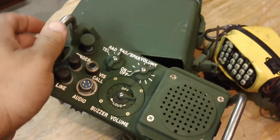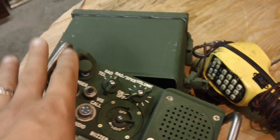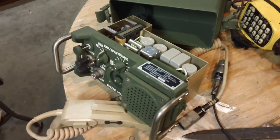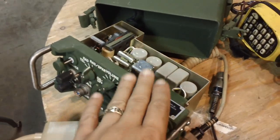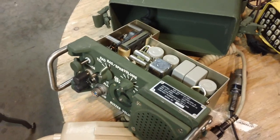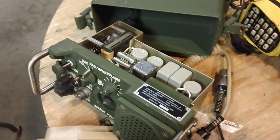This piece of gear is the 1911 of communications gear as far as remote control goes. There are three revisions — the B model is the most prevalent, so if you see a GRA-39 Bravo, grab it. The difference is that if you have the local unit near a powerful HF radio kicking out like a thousand watts — like illegal CB users with 1kW power amplifiers — the B model is immune to that radio frequency interference that would cause the earlier A models to go spastic.